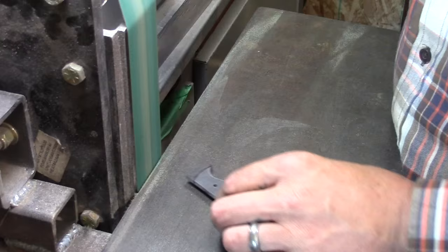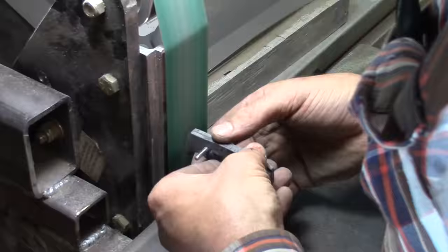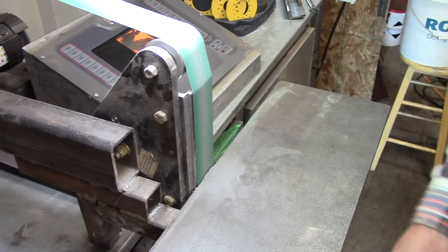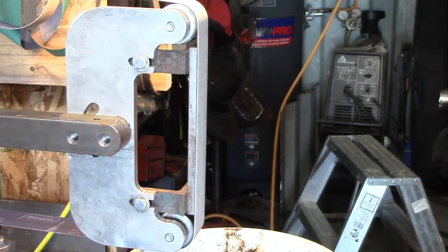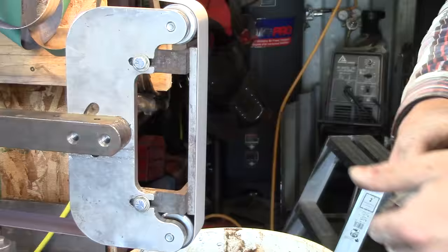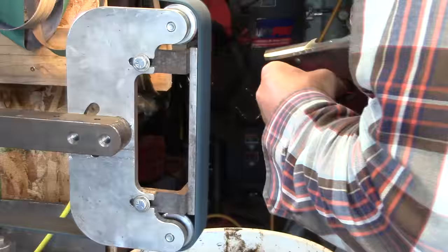I'll work a little bit on the profile of the scales, getting them set up before we glue them on. I also do a little grinding with the whole knife assembled together to get the G10 fairly close to the tang. Any profiling you want done right at the edge is hard to do once the knife is glued up. Then one more pass with the surface conditioning belt on the blade to get rid of any scratches or imperfections.